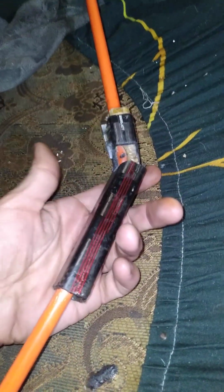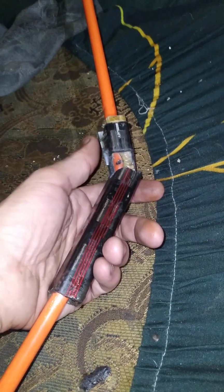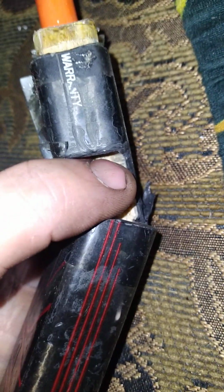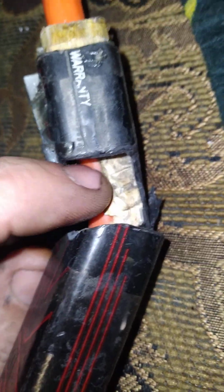And it's taught me a lot. This section, if I remember correctly, was out of the middle, towards the top, which is actually a bad place to take a riser from if you're going to put it under this kind of pressure. Also, as I talked about early on, I did not soak this with epoxy or anything else. And you can see that here. This is dry wood. Okay, that's really bad. This part here that was epoxied really solid, it's what I said. It came out really strong.